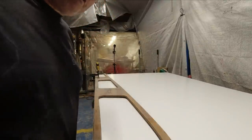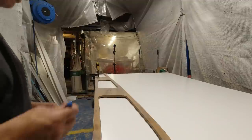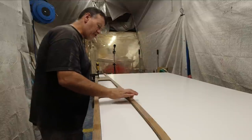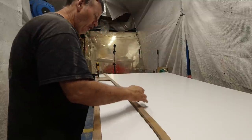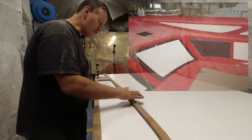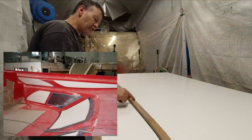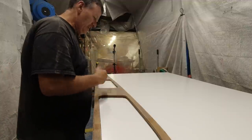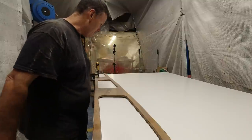This has been a bit of a big afternoon cutting all these out. I've got to now cut the last two out and then tidy up the edges and route them — route the top edge so that I get a radius to glass over. On the boat itself, I'm going to be putting a radius of plasticine down in this area so that when I laminate over the top I'll get that nice rounded finish. So this will need to be radiused over the top here on this board, then waxed up, but hopefully I can remove these out of the mould without damaging them.